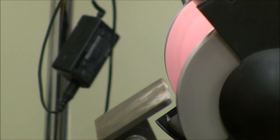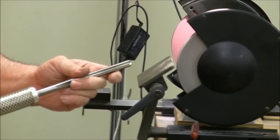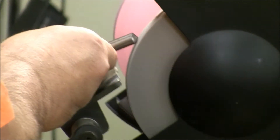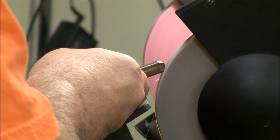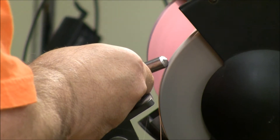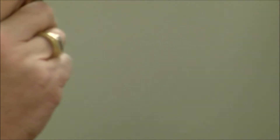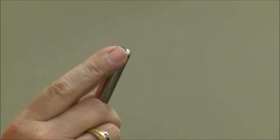What I'll do first is grind the angle I want. As I'm trying to go through the bottom of the bowl, I know that it's too acute, so I need to make it a little more obtuse. I kind of know where my hands are going to be. Now I've got that angle that I need, but I also know that I can't make that tight turn without the back part of the grind hitting the wood.